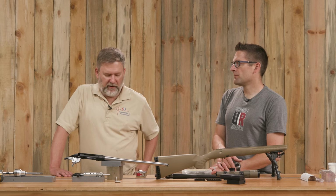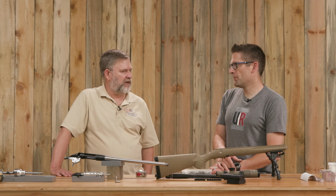So it's just a shortcoming in the functionality of how lathes are designed and made. It's not a shortcoming as a lathe, it's a shortcoming as a gunsmithing tool. Just being aware of that, the floating reamer holder solves that problem. I've heard machinists say, why would you use a floating reamer holder? You're allowing the tool to wander. And when you explain to them what it does and what its purpose is, they almost universally say, oh, well, that makes complete sense. It's just like a reloading press.